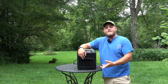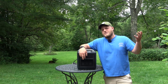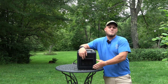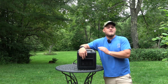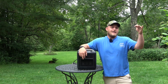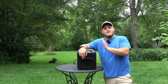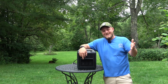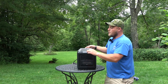I did my efficiency test here — that's really important, but all of these units are starting to get pretty good numbers. I'm always getting in the mid-80s as far as percent efficiency out of these inverters now, and this unit was no exception. It's very rare to see 90% and above — almost none of the portable power stations on the market hit that. What you want to avoid is the 60 and 70% efficiencies, and you definitely avoid that with this Acevolt.